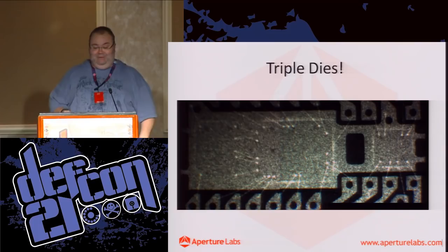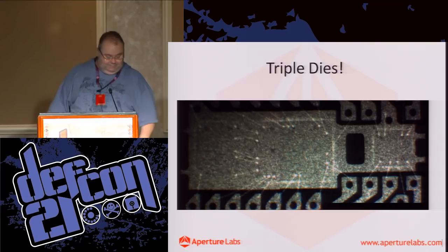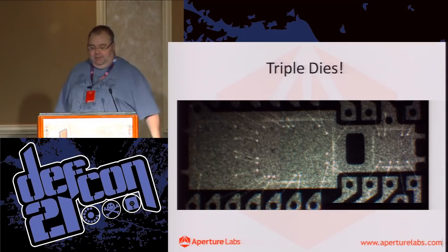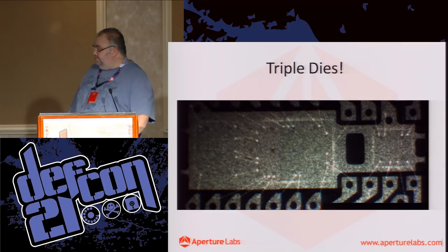Given that the guy in the middle is a processor and the one on the left is an EEPROM, what we were actually doing was looking at the bond wires between the processor and the EEPROM and watching the conversation between the two. And the way we figured out it was an RF chip was he pulled it out of the bottom of the jar when we plinked it and zoomed in. There was the manufacturer's part number on it again. Just look it up. Holy crap.